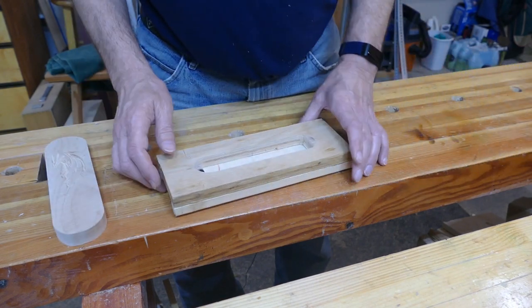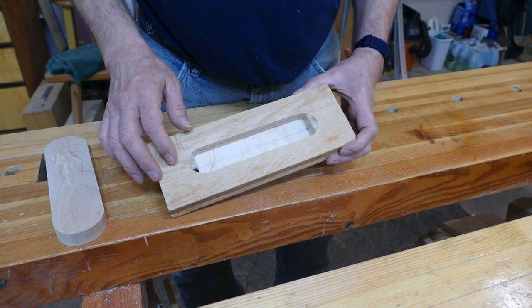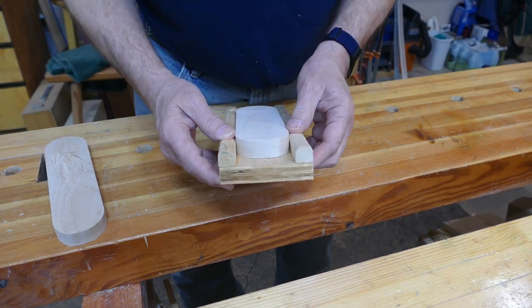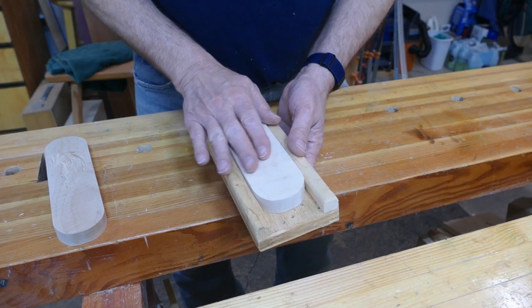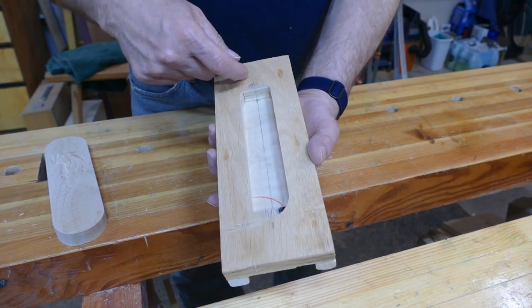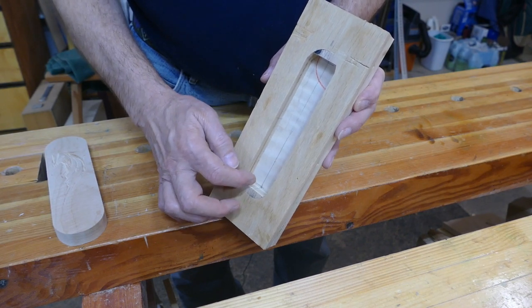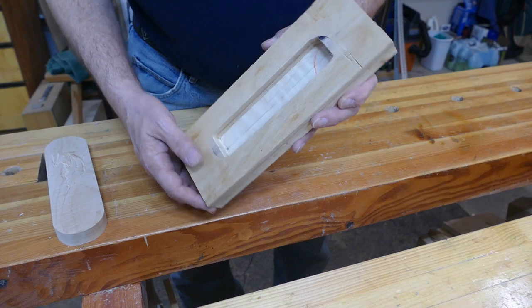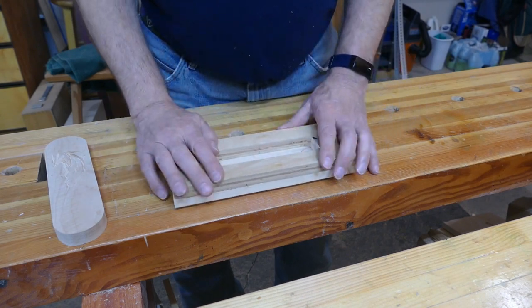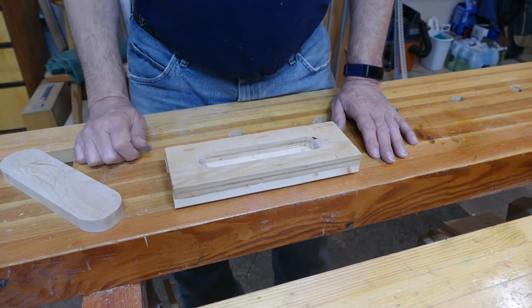I also have this routing jig — a pattern I had from a previous project that I modified. I put a couple of runners on it to center the workpiece, so I always have a nice jig for putting in the depressions. My router runs right down through the center. I'll be able to rout it out real quick. I also put pencil marks to center it both widthwise and lengthwise, and two-faced tape is holding the workpiece in. Let's go grab the router.